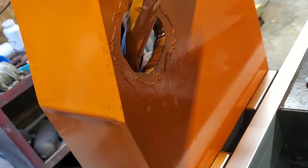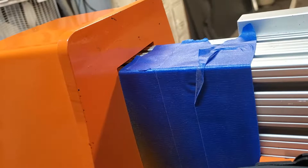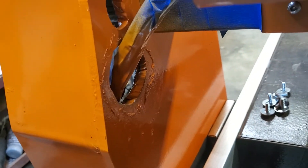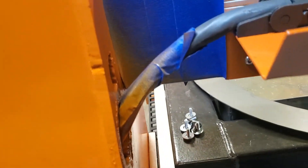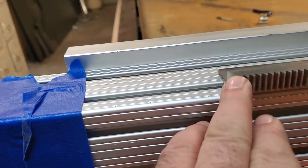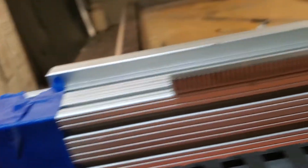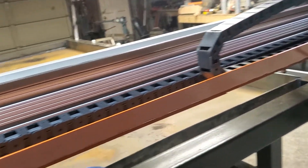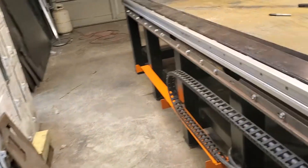I had a little mistake here — I went to put my cable through and I forgot about the big end on the plasma cutter connector; it didn't fit in the small hole, so I had to cut a bigger hole and repaint this area. Same thing on the other end where the rail ends — but I've got soft limits set, so the soft limits will stop it from ever going that far anyway.